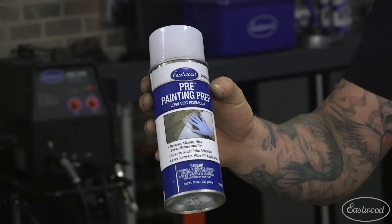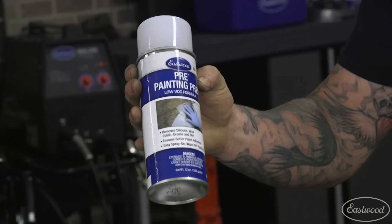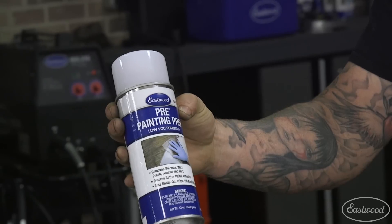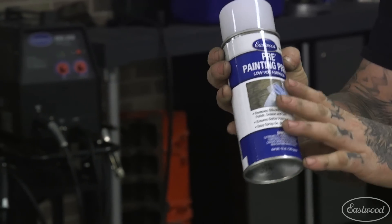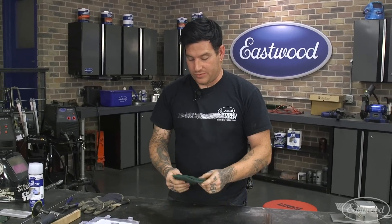One thing I want to stress: do not use anything but straight acetone or our low-VOC pre-painting prep — either of those are acceptable. If you use a standard pre or even brake cleaner, what it does is it creates your own mustard gas. Nasty stuff. If you spray brake cleaner on a part, wipe it down, and then go to weld, even though it may seem clean, it leaves a residue that when you weld burns off and creates a gas that goes under your helmet — basically mustard gas. It's going to give you shortness of breath, you'll get lightheaded. It's not a good feeling, especially when you're welding, and it's not going to help your weld.